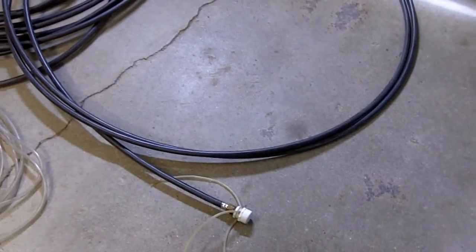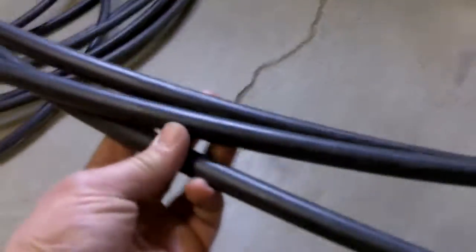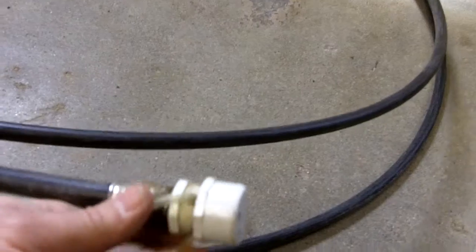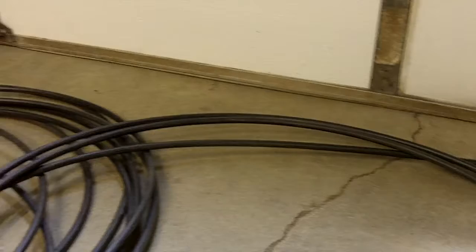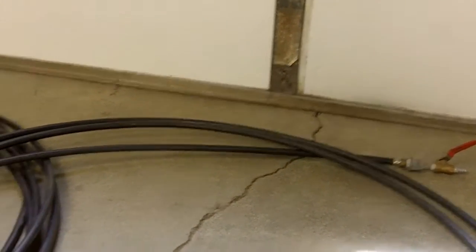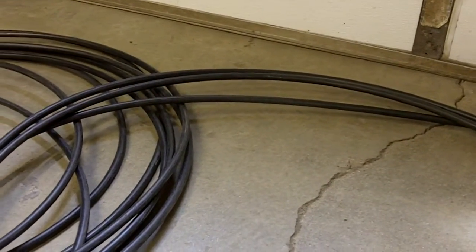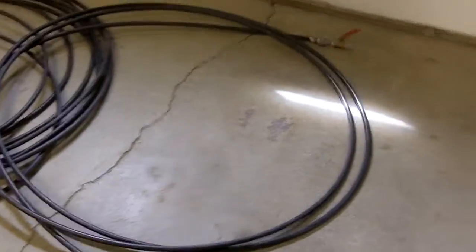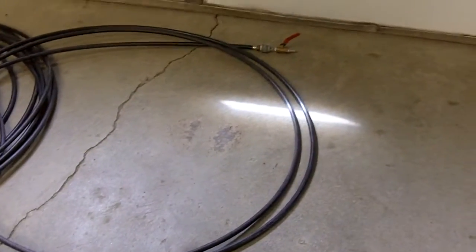We'll start with the very large ones here. These ones are a 1/2 inch line, made of a very rigid tubing. This particular one is a reverse style whip, and we'll go over the details of the heads a little later, and the type of whip and how to make them. This whip here is used strictly for commercial, generally long chutes. We have several commercial properties that we take care of on a regular basis that have dryer vent shafts which run up to 8 stories.